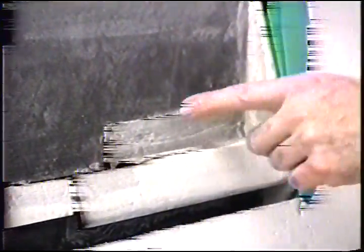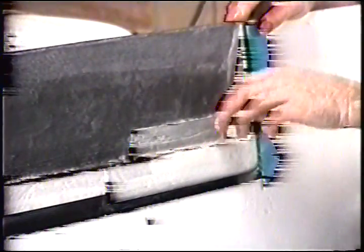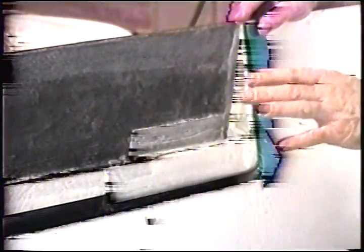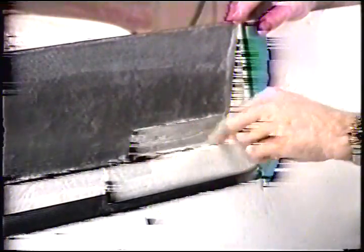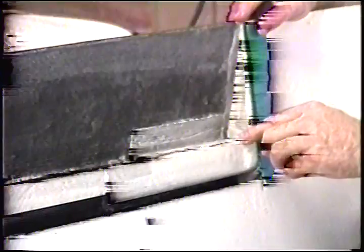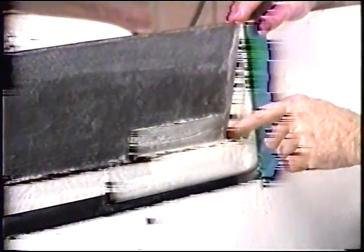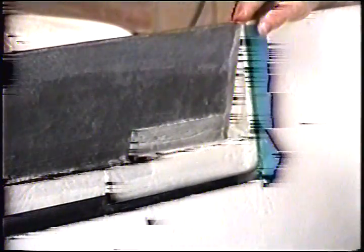So I decided to mold a 3-ply layup that I had my guys bag in place, and it keys into the corner, resulting in a depression that is always precisely in the same place. So consequently, those of you who have ailerons that don't have the torque tubes, it's real obvious where they go. You'll find a depression and a 10-inch tube. You'll place the tube in the depression and Cleco and pop rivet into place as you do your assembly.